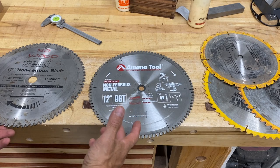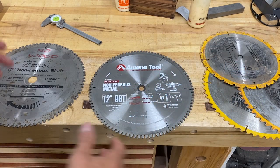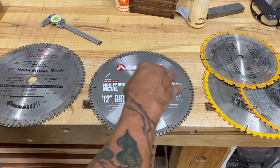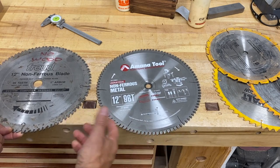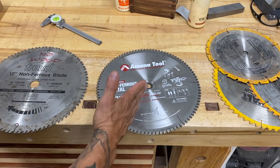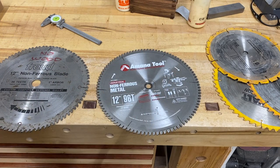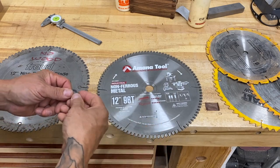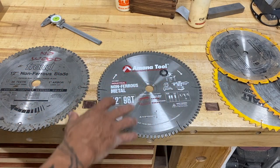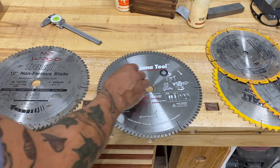Pricey — totally worth it in my opinion. This last little pile — these are just the blades that come with your chop saw. I use those if I have cement-encrusted two-by-fours or I'm going to hit a nail — I don't care, those are disposable. Those won't ever get resharpened; they're just kind of my trash blades. These two blades are for non-ferrous metals — a couple of different brands, but they both work really well. They have a very negative hook; you can see how the teeth are laid back for aluminum, brass, copper, gold. These have the one-inch arbor, so I just need the adapter to run them on a 5/8ths shaft. I can use these on my chop saw or on my 10-inch table saw with one of these adapters.